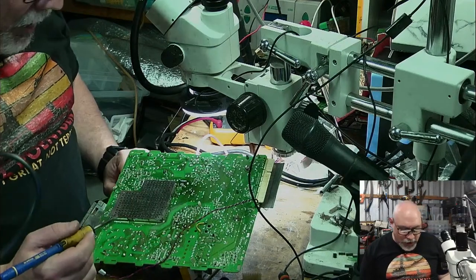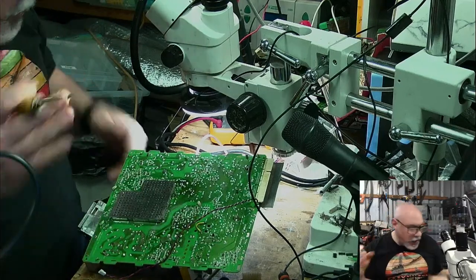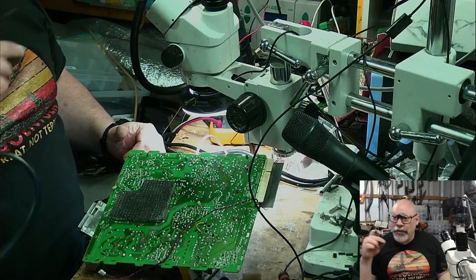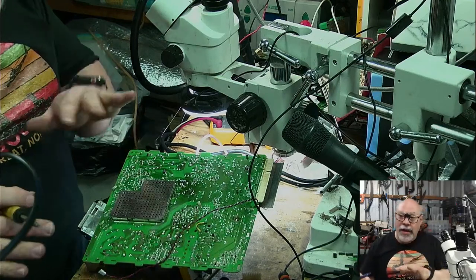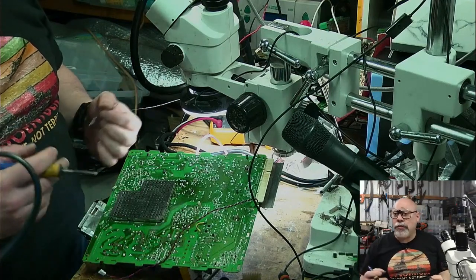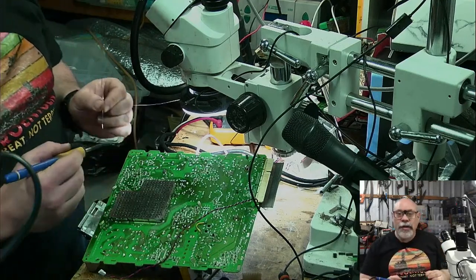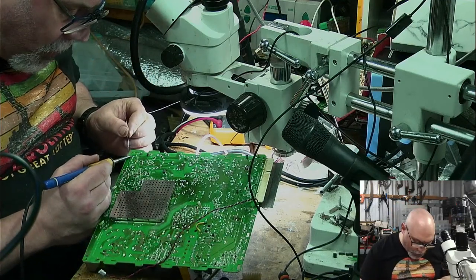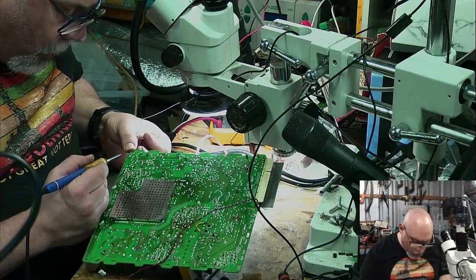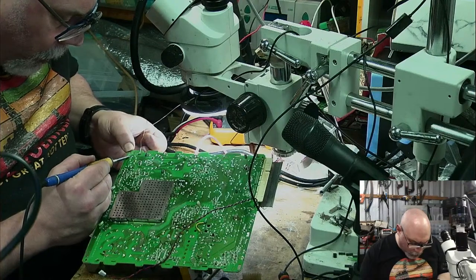Alex sent me an image on Discord the other day of a ribbon cable that was falling apart. I don't know the exact details of what had happened there. It was basically trying to reattach wires to the ends of the ribbon cables. Now, I have had problems with ribbon cables before, and the one advice I would have is just don't try dealing with them. When you try and solder things to them, they just melt, they fall apart, they're a nightmare. You've got to try and get hold of a new ribbon cable or one that's close or something like that. I can't really offer any other advice than that. It takes courage what you're doing there, Alex, that's for sure, but I think you're mad. I got the impression from what you were saying to me, you don't have much of a choice. You're doing this for someone else and you're trying to get it sorted.